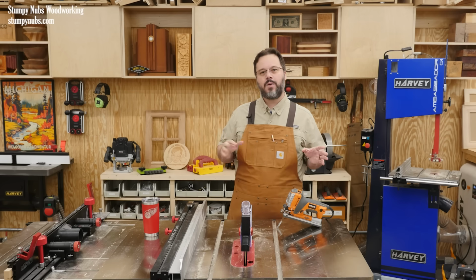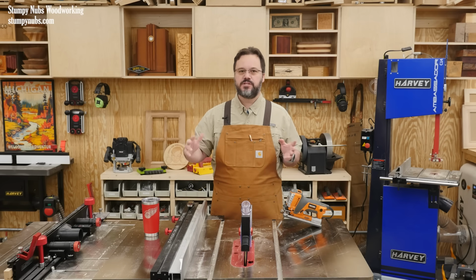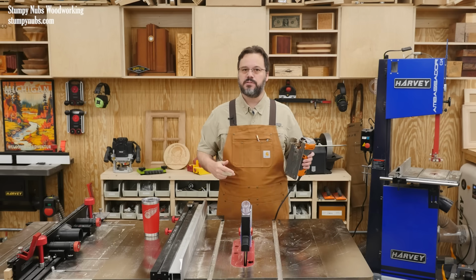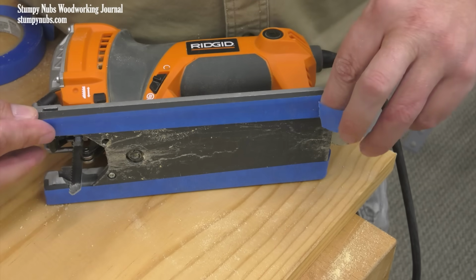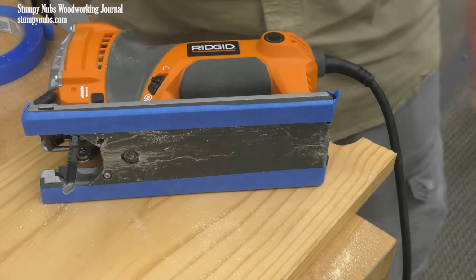We talked about how wax can help your saw move across the surface more smoothly. This is true with both curved and straight cuts. Many saws have plastic shoes, but some have metal ones. Either may create fine scratches in some surfaces. If that's a concern, consider placing a couple strips of painter's tape on the edges to serve as non-marring skis.